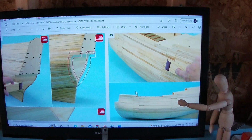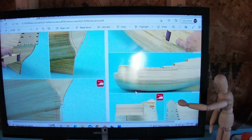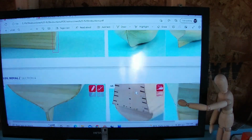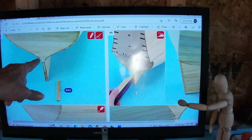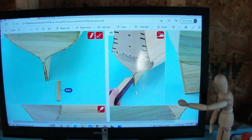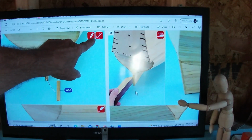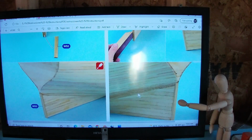So the next step in the instructions, after we get those openings closed up with the last boards, is sanding. And then after sanding, put this little rudder plate on the butt of where the rudder's going to go, but the plate needs to be recessed so that the front of it is flush. So we had to do a little cutting and layout to get that recessed the amount that we want for the thickness of that board. And I did install that.